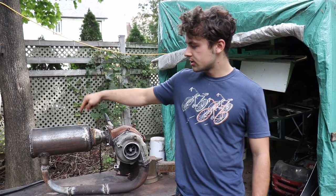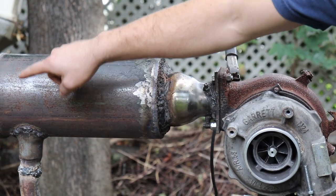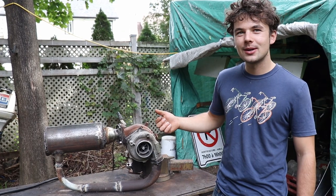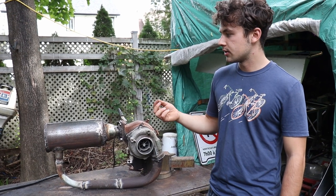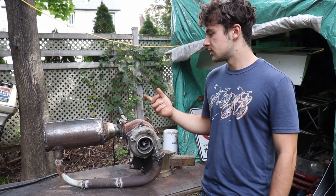Inside this combustion chamber, there's a flame tube. So the air comes in, goes into the flame tube, gets mixed with the propane that's gonna come from the top. There's gonna be a pipe of propane coming from the top. And it's gonna get mixed with that, get ignited by the spark plug, and then that's gonna generate a lot of heat energy and kinetic energy.